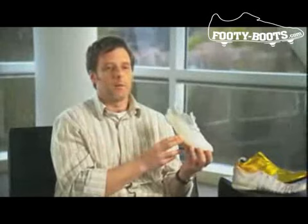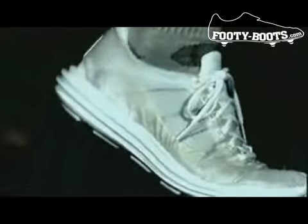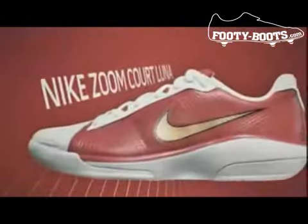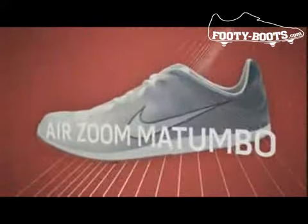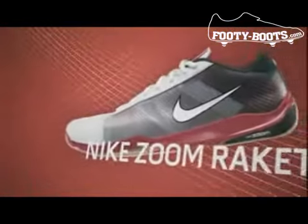We found a better fiber, which is Vectran, to integrate. It had actually better flex while holding its strength, and was really stronger even than Kevlar, considering the violence of the stitching process and how much flex actually occurs in a pair of footwear. It was the perfect fiber choice for us. It's pretty quick that you say, well, maybe we can make a basketball shoe, maybe we can make a tennis shoe out of this. So that was a natural extension of the project — it opens a whole new realm of opportunities for building lightweight products.